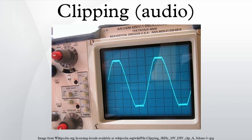A more complex circuit, called soft clip, was used from the 1980s onward to limit the signal at the input stage. The soft clip feature begins to engage prior to clipping, for instance starting at 10 decibels below maximum output power. The output waveform retains a rounded characteristic even in the presence of an overload input signal as much as 10 decibels higher than maximum specified.